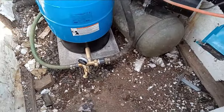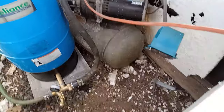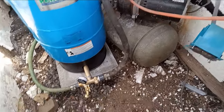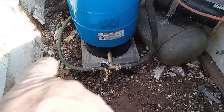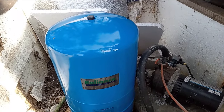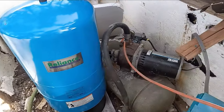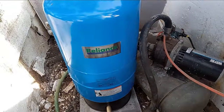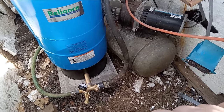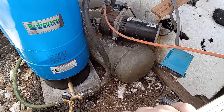Got everything connected. I didn't want to move the well pump — it's very heavy and hard to get in here — so it's fine, it's been fine for 10 years. Until spring I'll leave it alone. I got these hooked up from the well pump. These tanks come pre-loaded, pre-filled with 28 pounds of air, which is what I need because my on-pressure is 30. You're supposed to go two pounds below. Now I should plug it in and it should start filling the tank.